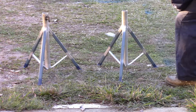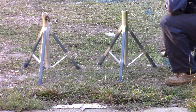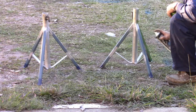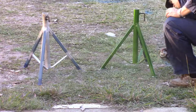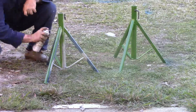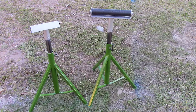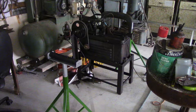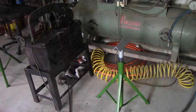I couldn't really plan on painting these — I just need to cover off the weld areas to stop the rust. The pipe's galvanized, but it does make it look finished. Everything else I've built has been painted deer green, so I figure why ruin the tradition. The stand sits on either side of the hacksaw and they work beautifully. I put the stand with the roller head on the inside of the hacksaw because that's where most of the weight goes, and I've leveled it up to the height of the hacksaw. The other stand with the angle head goes on the cut-off side of the hacksaw just to catch the piece that's coming off. I've set it about a centimeter lower — about half an inch — so the piece can fall down onto it and I'll catch it. It works beautifully.